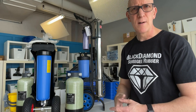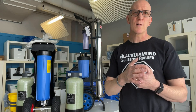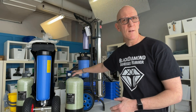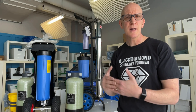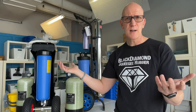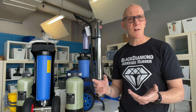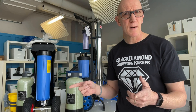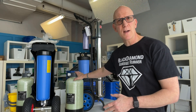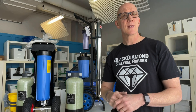DI uses hardly any pressure at all — regular tap water, if you hold your brush with the tap fully open and the valve to the system fully open, you'll have water shooting out three to five feet, which is actually a big waste. I always tell people to preserve the life of their DI resin by turning the water down — you really only need water flowing about a foot out of the brush head before it falls. You can clean windows for as little as half a gallon per minute. Of course, if you're using brushes with fan jets or rinse bars you'll need a lot more water, and you may need to consider a booster pump.